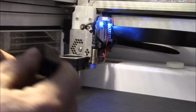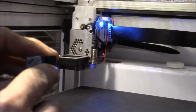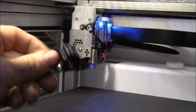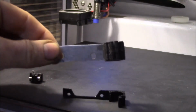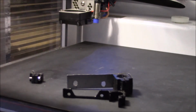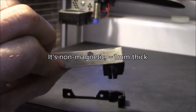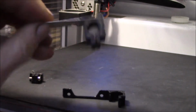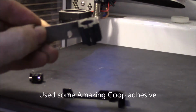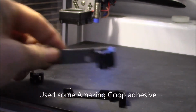I had to pick up one of those, and then you also have to chase this hole for an M3x0.5 screw. What I've done is made this replacement out of some stainless steel I had. Just cut a piece the height of the sensor holder, then bent a 90 degree and glued it in place. So I think that's going to be pretty solid.